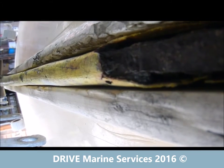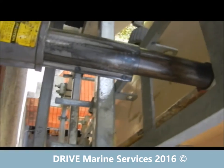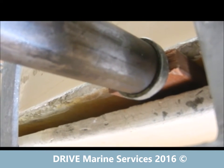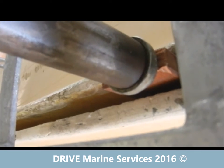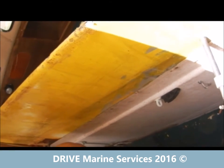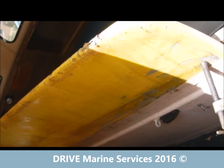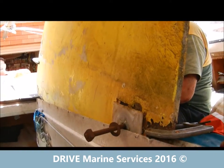We've pretty well got the keel out — the Toyota jack works a wonder. We've learned you can't take the keel out through the bottom, you've got to take it out through the top. We've used different pieces of merbau timber, jacked the front up, locked it with a clamp, then jacked the back up and increased the size of timber until we've got it poked out the top. We jacked the rear of the centerboard up a bit more to get it clear, leaving the front in about 100mm, then slid her out. We're pulling him out — we've got him sitting clear now.